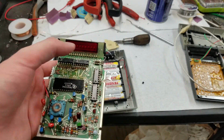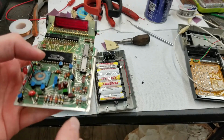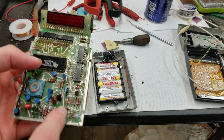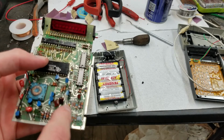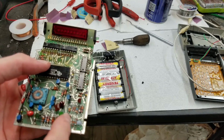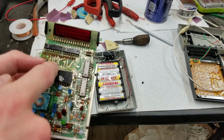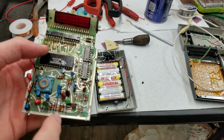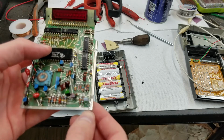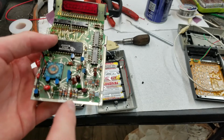So you may ask yourself, where does that little dash come from then? Well, that's also controlled by one of these, I forget which one it is, but one of these transistors actually directly connects that segment to positive voltage when the digit 5 line goes high. So this circuitry, which again, sorry, I'll show that schematic in a minute. I just have to clean it up a little bit because it's kind of messy right now and you won't be able to really read it.